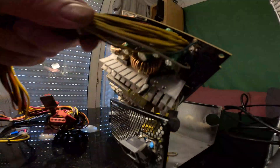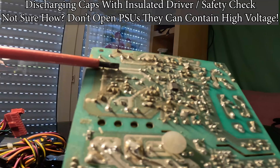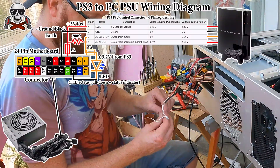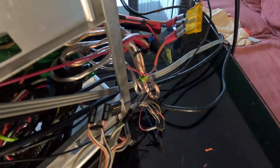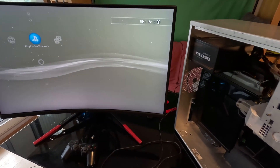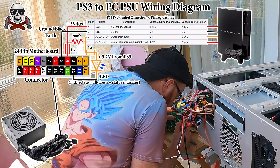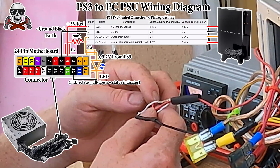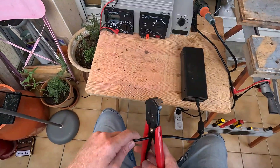We actually need to use all the logic that the real PlayStation PSU uses to trick the PlayStation into going into standby mode. 5 volt uses a red wire, grounds use black. I always put fuses on my live wires when doing experimental wiring — you always fuse the positive so that it pops instead of the console. The PSU blew because the short was before the fuse, inside the PSU — that's why I've only bought cheap second-hand PSUs for this project. Pin 3 I'll connect to the front panel HDD LED so I know the PlayStation is running. For pin 4, I salvage an old resistor — red, black, brown — giving us 200 ohms to drop the voltage down to around 4.65 volts.